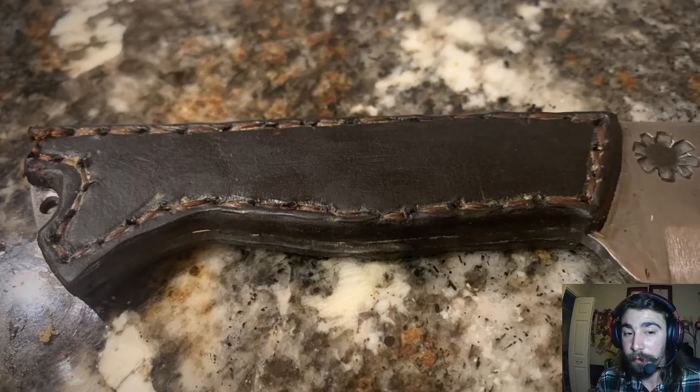That is the leather stitched handle. It ended up being quite thick and felt really good in the hand. I really like the squishy soft leather texture, and since it's thicker — eighth of an inch thick — veg tan leather that you can buy off Amazon for like 50 to 60 bucks Canadian, and they give you a big roll of it. One of the things I really want to do when I start teaching knife making courses is this style of handle, because it's quiet work.